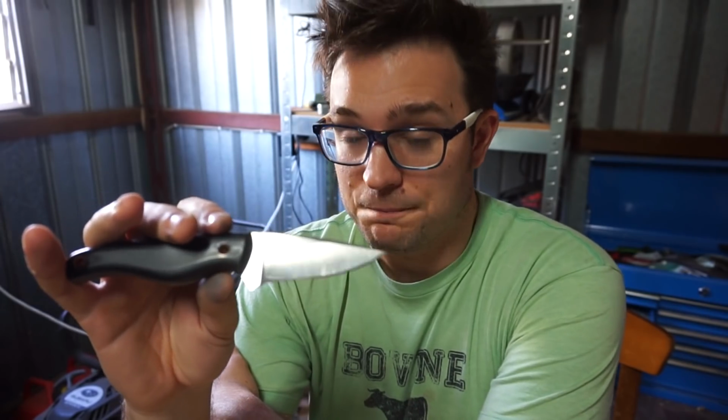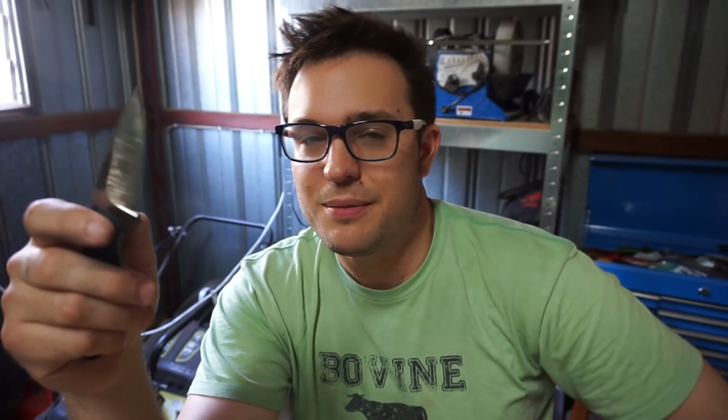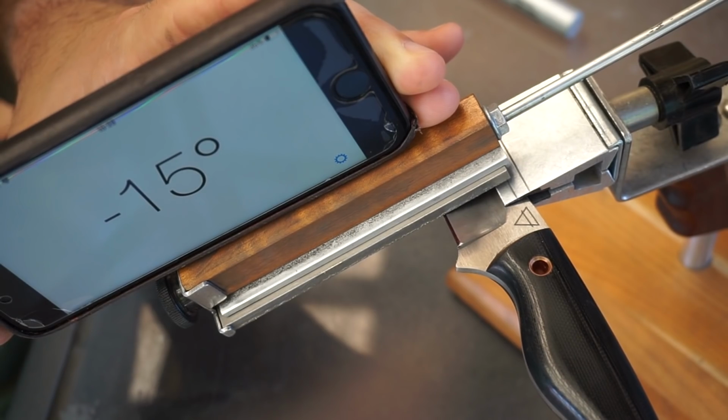A huge improvement. And then I thought, well, maybe being a high carbide steel, it likes a coarse, rough edge. So I put a 300 grit finish on it, which didn't work so well. It went to about 500 or so, but my conclusion was it was probably almost too coarse and bunching up with bits of rope crud between the actual teeth, making it a gummed up knife, to use a highly technical term. So what I've done today is I've gone to 600 grit and then I've finished it with a Tormek strop.